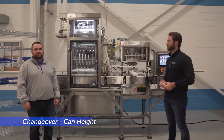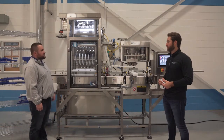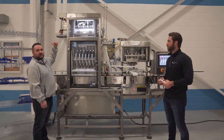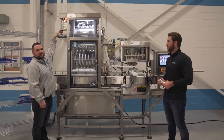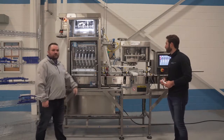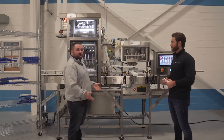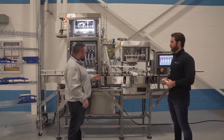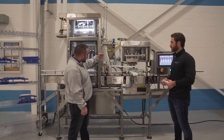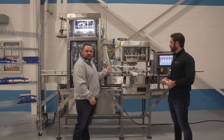Let's quickly talk about changeover. In this instance we are going to changeover from a 12 to a 16 ounce can. With the filler it is designed with a hand wheel — you are going to wheel the filler up and with this counter you are going to set it at a designated height that is preset on your HMI. Then we are going to move over to our gassing tunnel and our lid feed assembly, break that loose and slide the whole assembly up. We are going to insert the taller 16 ounce can on the conveyor and set that height so the flange of the can is able to pick that lid out of the terminus.